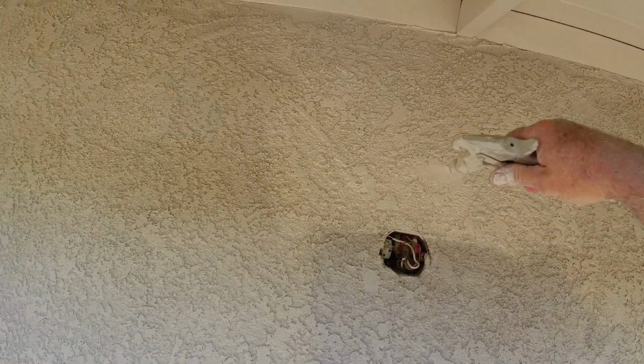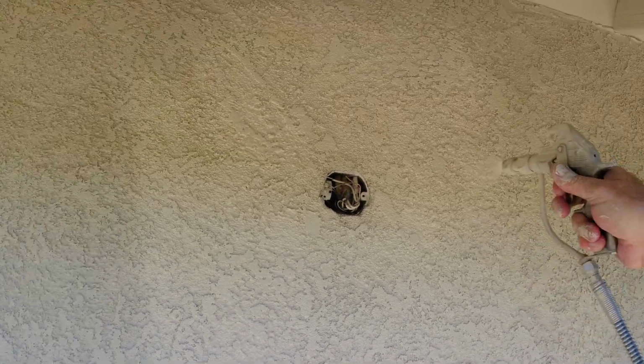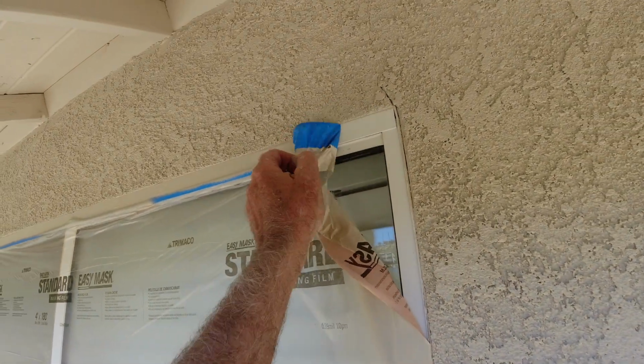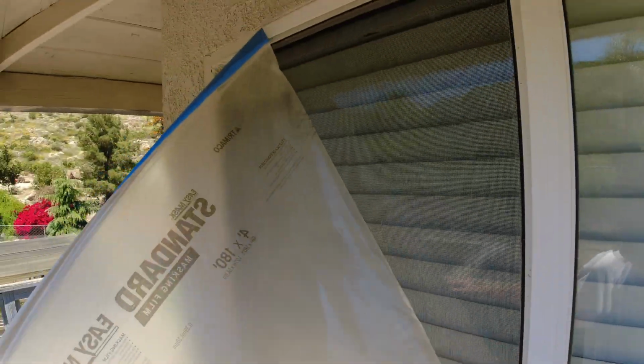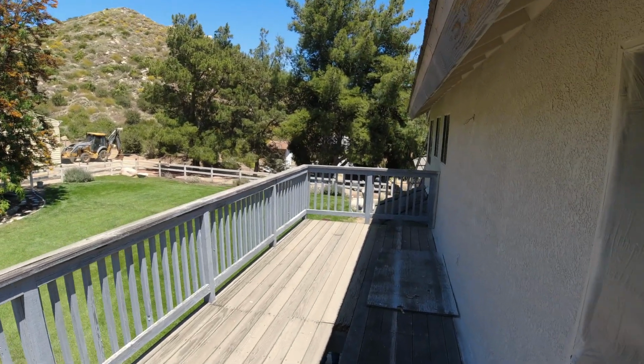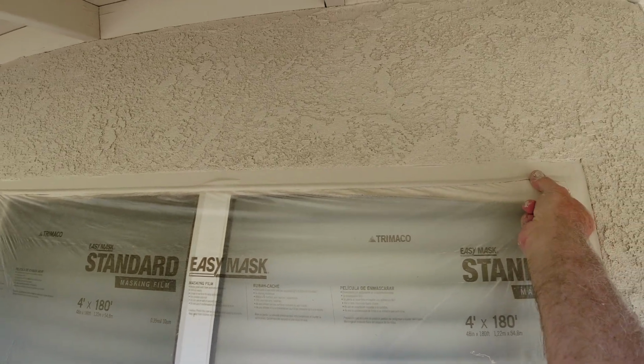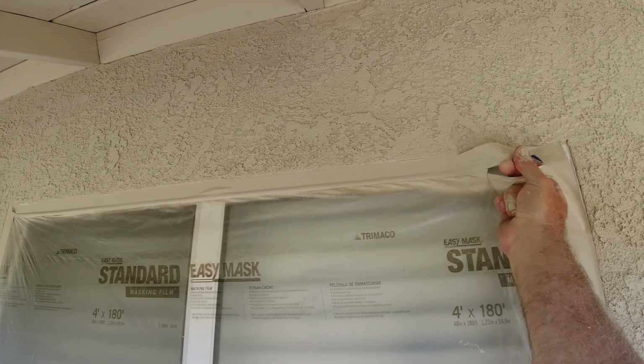I really don't like it when people buy those corrugated ones, because then I've got to scaffold it and use ladders and risk damaging it, and I always have them sign a waiver that says I'm not responsible, because it's not designed to walk on, and you've got to walk on it to do the work. Oh, you're not going to damage it, are you? Well, you should have put up one that you can walk on. You've got to go on top of it. Who's going to do the work above that? Oh, never thought about that. Okay, well, we do our best not to damage it, but you should have gotten one that has a foam core in it, because they're designed to be walked on. It's not a deck, but it's designed to walk on, so you can do work above it.